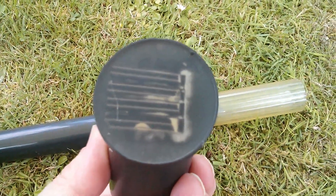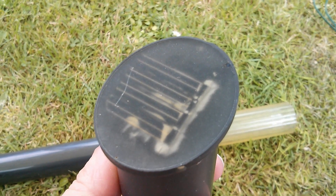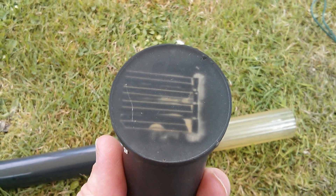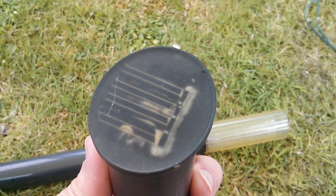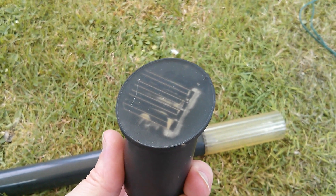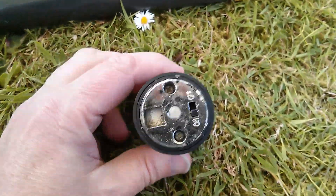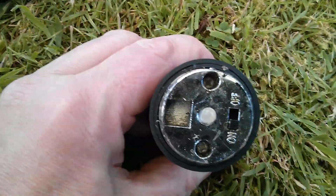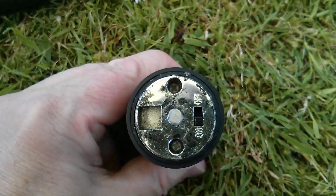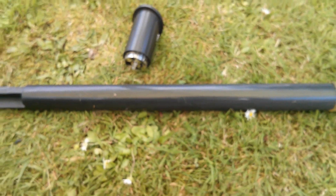This is probably mono-crystalline or poly-crystalline strips of solar panels linked together with a metal tabbing strip, then coated in a sort of plastic resin. The trouble is the plastic resin eventually goes cloudy — it's started to happen here — and also cracks up, and eventually moisture gets in. Mono-crystalline and poly-crystalline don't fare as well as amorphous in that respect. Pound shop solar lights seem to have the uncanny knack of lasting exactly a year and a day, so you can't take them back under warranty. This one has failed, so it can go in the bin.